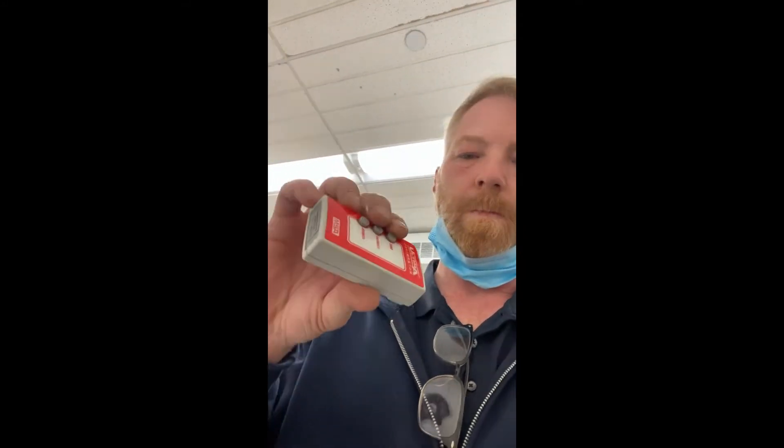If you find yourself in a situation where the sensor is going erratic — going high, going low, staying low — you can go in and do a recalibration of the sensor using one of these. So typically you come in here and we'll do the zero and calibrate buttons at the same time. Hold it for about five seconds. It'll go through an iCal. That will clear it and steady out the sensor for a little bit.